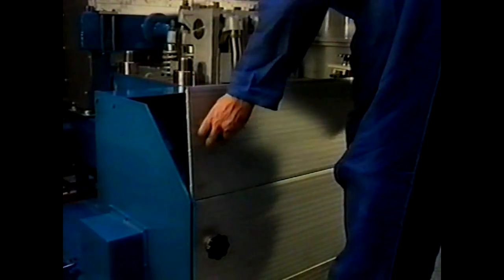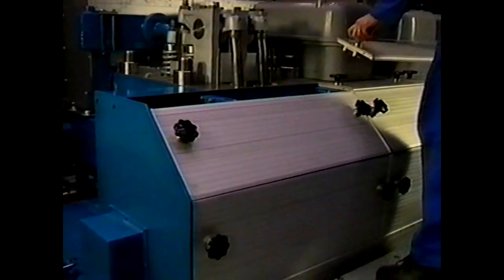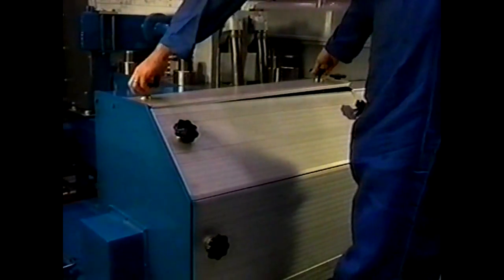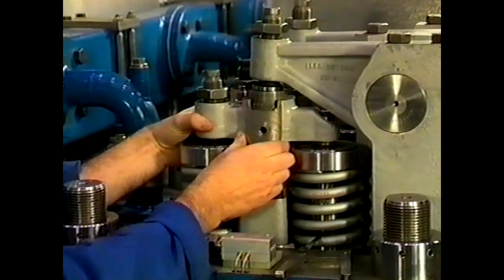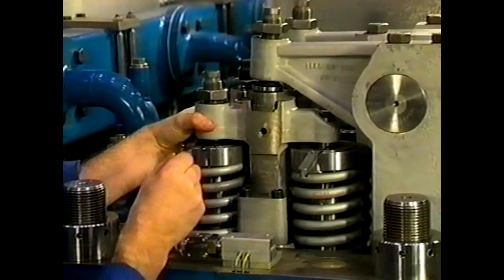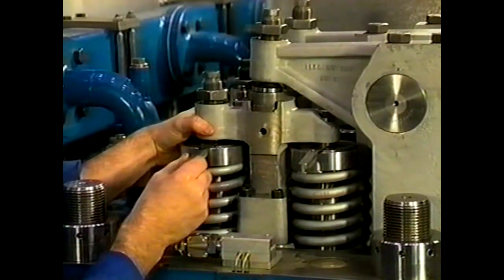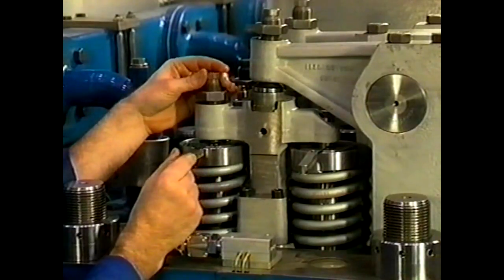Check if at the operating side of the cylinder head no parts or tools are left behind. After that, the panels of the hotbox can be mounted. Subsequently, the valve clearance has to be adjusted. However, for this purpose the yoke has to be adjusted first in such a way that the clearance at both valves are equal. Consult the instruction manual for the correct procedure.